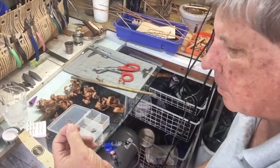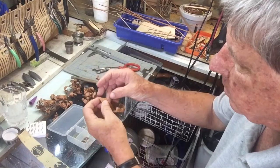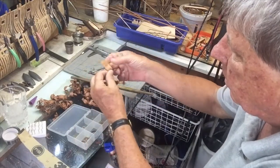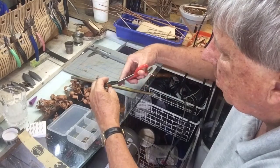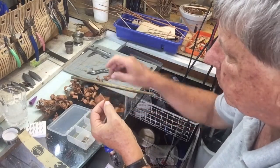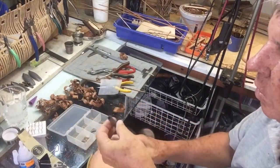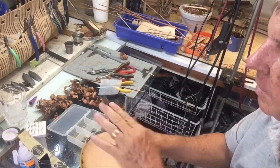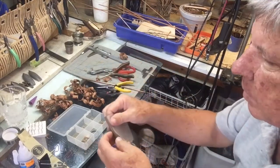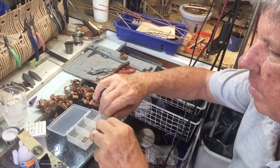This is what we are attempting to make — these laser-cut pieces. So coming to our shaving, the first thing you want to do is cut it and square it off. In a perfect world you would want to sand the edge down — I tend to do that afterwards. The next thing I do is put some wax — mold release wax is what I use — on the pipe, because I don't want anything to stick on it. Simply rub it down quite liberally. Then I put a piece of wax-proof paper and wrap it on the pipe again, very tight.